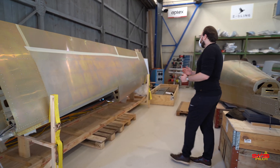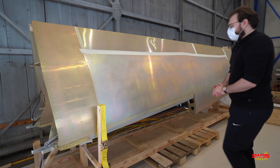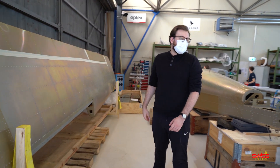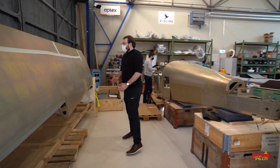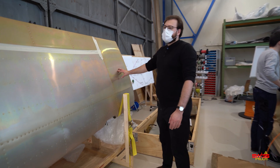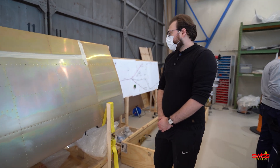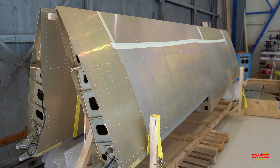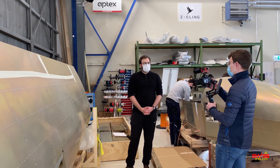This is the wing. We will place the battery box in this part of the wing, and then we have a second battery box in the second wing and a third battery box in front of the canopy. What is special about this wing is we elongated it — first with one part and the second part will be elongated by the winglet which will be longer. This increases the efficiency of the aircraft flying, which is quite important for us as electric aviation still has a range problem.